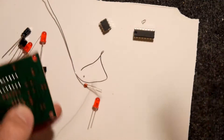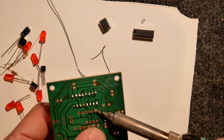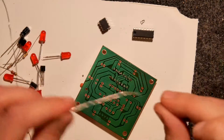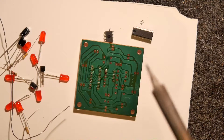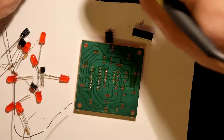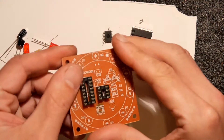Continuing with the 555 timer - exactly the same process. I'm going to try a different trick: take a blob of solder on the tip so there's a drip on the end of the soldering iron, and just plop that on the end. That's holding the IC carrier in there, so I can go finish off this socket. My soldering iron is way too high - it's oxidizing on the tip. I've got it set to 480, which is a bit hot; I'm going to bring it down to 400, actually 375.